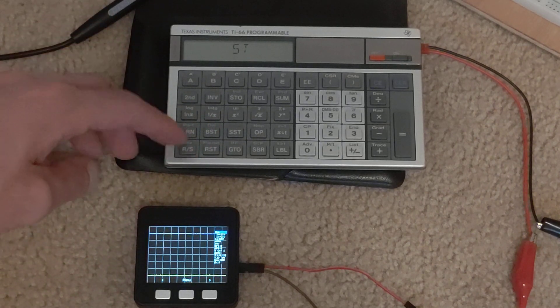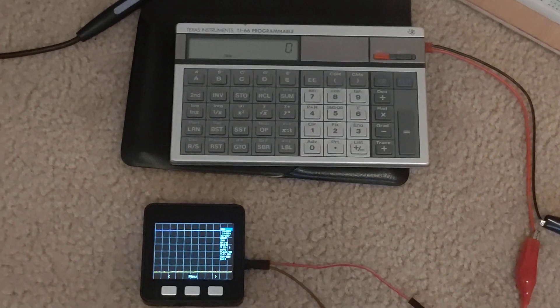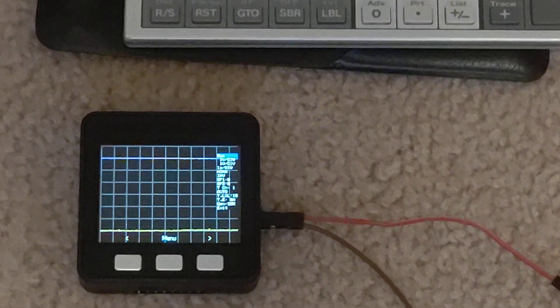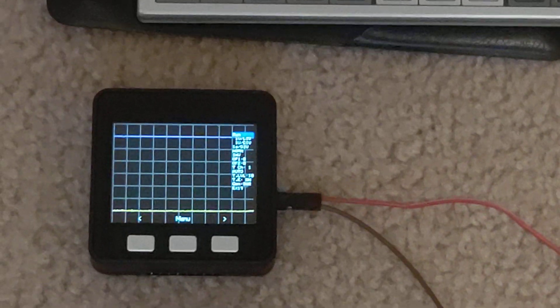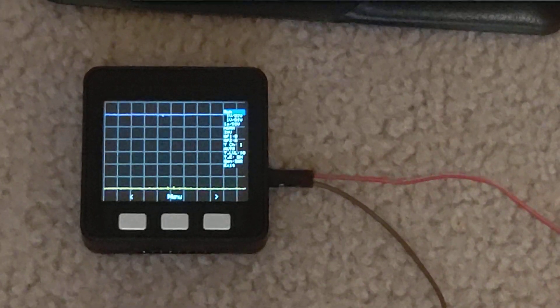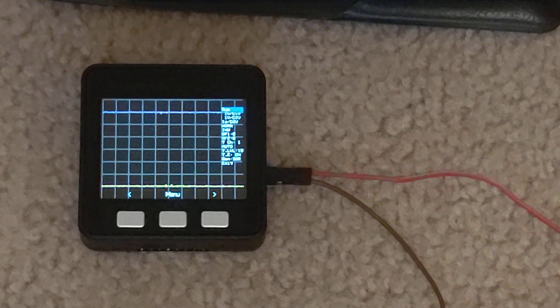I'll play that again. RST. Let's zoom in and watch that trace. Notice what the peaks are — I think it's the second channel that's picking up signals, so I think the bottom wire is ground and the top one is serial output. That's important to note.